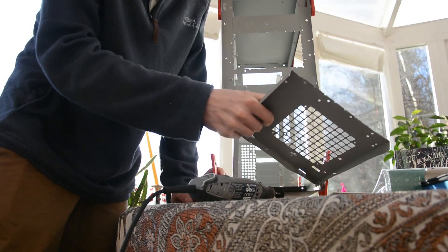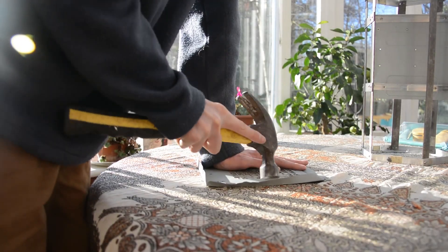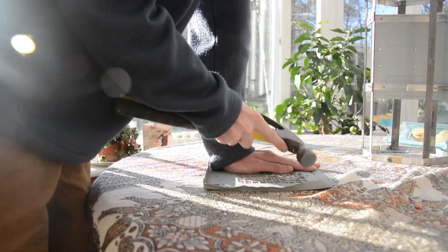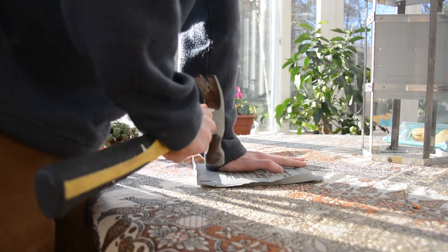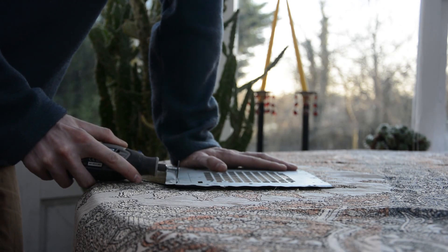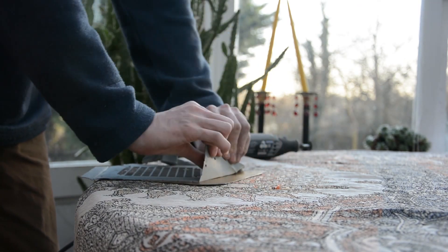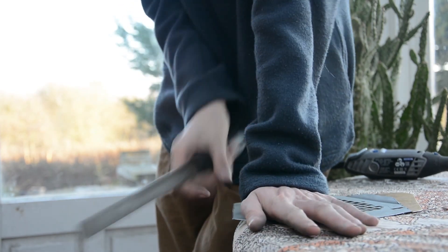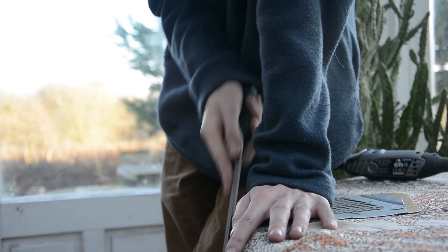For the fan mount I cut it out of the case and used a hammer to flatten it down. After this I used a case to get hexagonal markings out where I could then cut the fan mount. Following that I removed all the excess pieces of metal from the fan mount and cleaned up the edges. I also created small indents where the steel bars are, as they were intruding into where this piece of metal actually goes.